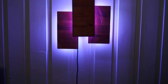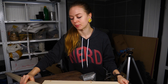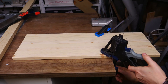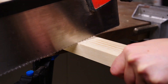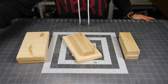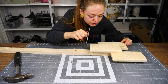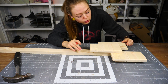The second lamp is going to look something like this. I'm going to use the remaining part of the plank from the previous lamp together with some 2x1 to make this lamp. I'm going to grab my handsaw and cut out three equally large pieces of both the plank and the 2x1, and then put it together. It's still looking pretty rough along the edges, so I'm just going to quickly go over it with a sander. The next step is to put these together using wood glue and nails. I think I'm going to have to lift up the middle part — that gap is too small, so I'll cut two more lengths of 2x1 to lift it up enough.